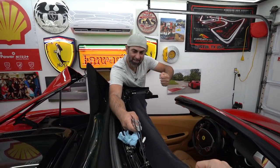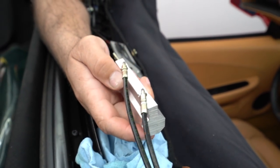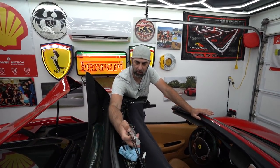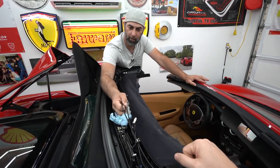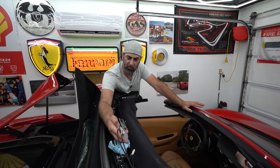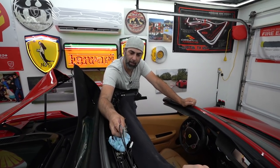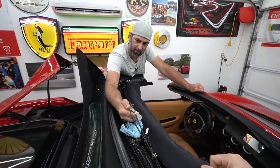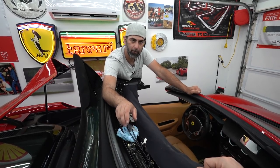Back to the repair: the factory crimped lines make you think you have to pull them off at the pump down inside, doing a whole kit. But there's a workaround — grind the aluminum off the cylinder to remove the crimp, pop the lines out, and send the ram to a rebuilder. They'll machine it, face it clean, and modify it with a serviceable clip to hold the line. If it ever fails again it'll be a quick 10-minute job instead of an hour.